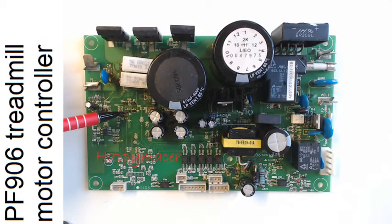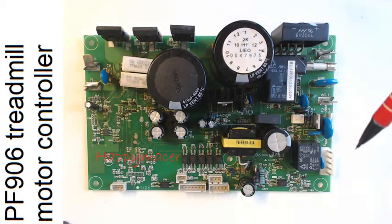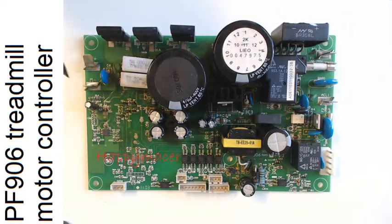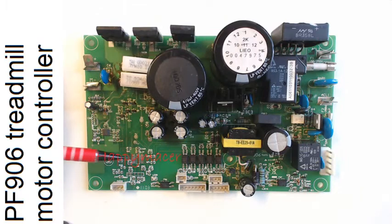The PWM comes in on this Q3 transistor base and there's a control voltage on Q6 which turns the totem pole on or off. This relay can be turned on remotely via this FR7 optocoupler. When you turn the relay on, the voltage is applied to the motor control circuit. Normally it's delayed so that it allows the switch mode power supply to start up and get ready, and only then does it turn on the PWM.